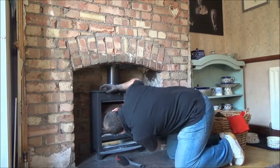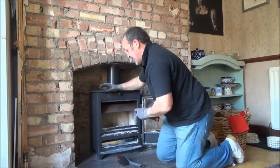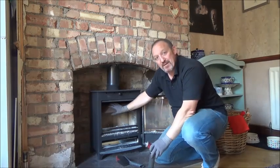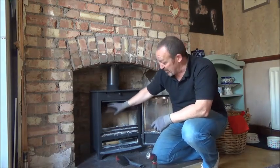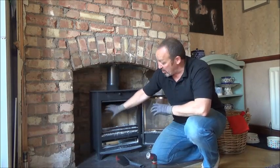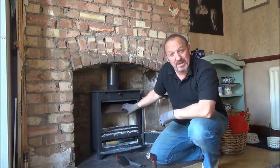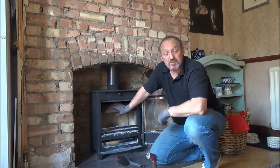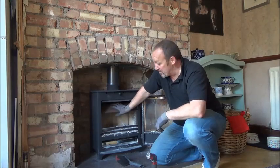Checking I haven't missed anything. Check the actual back of the smoke diverter as well — if there's any pitting or there's sulphur build-up. Yellowish sulphur build-up on the back could be a bigger problem. So if you've got a lot of sulphur build-up on the back of this or a lot of pitting, call the chimney sweep or when they come round next, ask them to have a look at that and see if there are any additional problems.